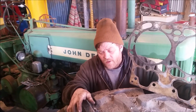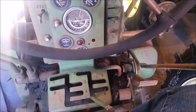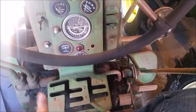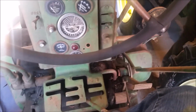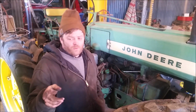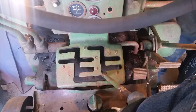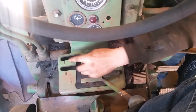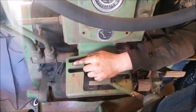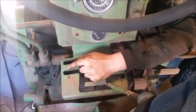They're all different if you have a pony or if you have electric starters. And they have different transmissions also. So if you're ever out shopping, he can tell you about that. But we have two different transmissions on ours, right? Yeah, this is a slow one. This is a fast one. On the diesels, they had an option. The way you can tell, first gear is over reverse. It's a slow transmission. And on a fast transmission, this will be second gear.